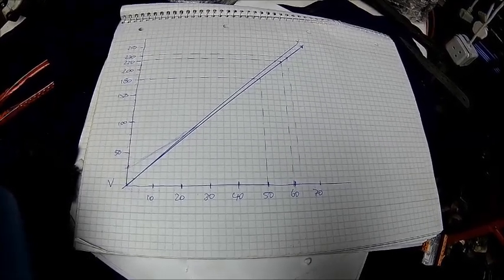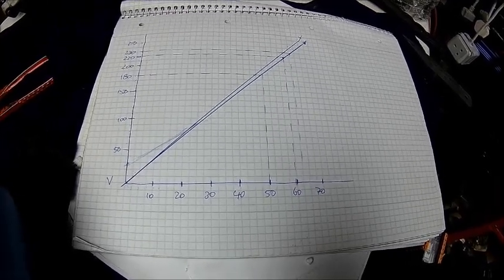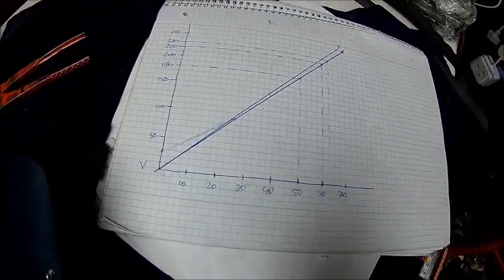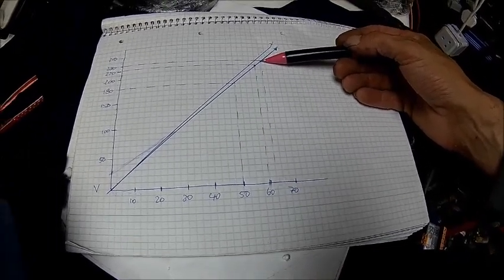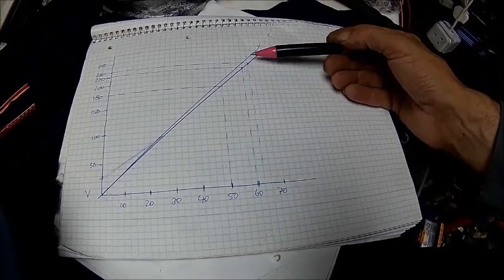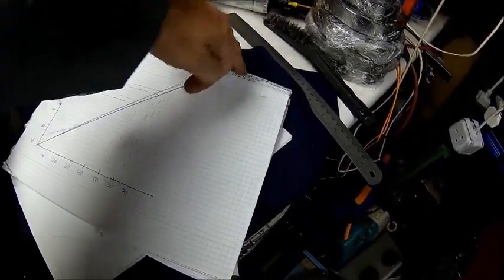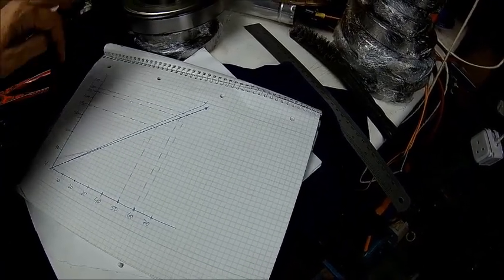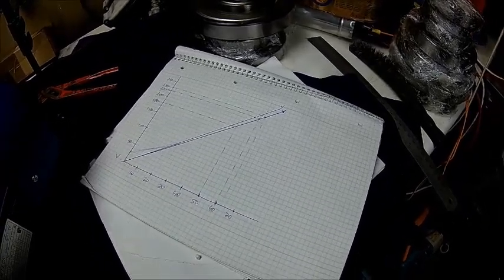Hope that makes sense — any questions let me know. That explains why I was keen to get these 60 Hertz motors with that low voltage rating. Because we can run the motor — it's rated around 1750 RPM — at full torque, and that's exactly what I want for the lathe. If we do that with 400 volts, we can do it at 87 Hertz — that's about 95-ish Hertz — at full torque with a 400 volt supply.